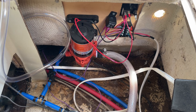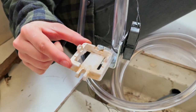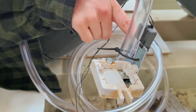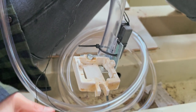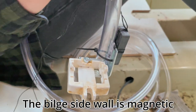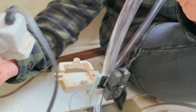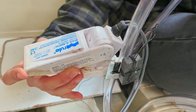Now let's connect these, add some water, and see if it pumps. We have our float switch bracket attached to the bracket which will also hold our hose pump. On this side we have a magnet that will keep the float switch sitting level and upright properly at the bottom of our bilge. This will adhere to the side of the bilge and help keep our pump perpendicular to the floor so we can guarantee we're actually sucking up water. After it's dropped in, we can clip the float switch into place and it should function.